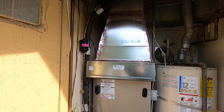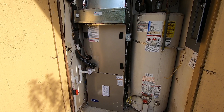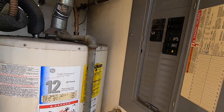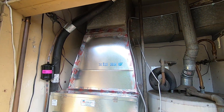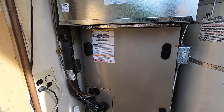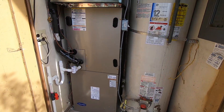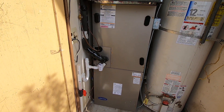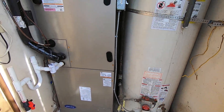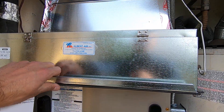If you'd like more information on going from a gas furnace — in a closet, attic, basement, garage, or wherever — and converting it over to a fan coil and heat pump system going all electric, what it takes is a dedicated circuit right here. We also have to adapt to your existing ductwork. Right here is the return plenum where the air comes in, and it goes to a supply plenum under the house. The fan coils are a little larger — this 3- to 4-ton unit is 22 inches wide by 22 inches deep by 54 inches high — so we need to make sure it can fit in the closet or space you're considering. Sometimes your existing furnace is only 17.5 or 14.5 inches wide, so we have to check that. Then we cap your gas line, get rid of the flue vent, pipe in the refrigerant lines, and do the condensate drains.